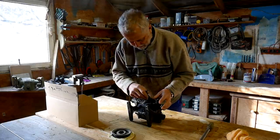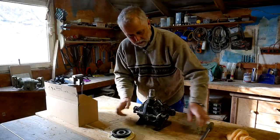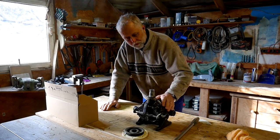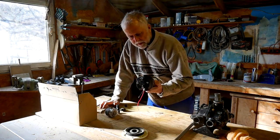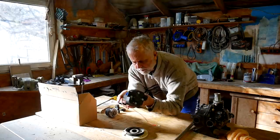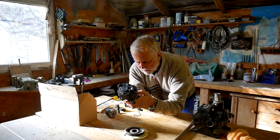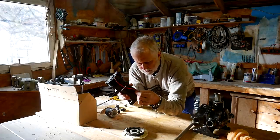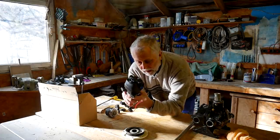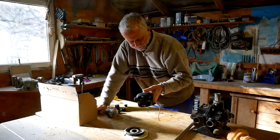I say with two chambers, so that will be going in somewhere. Got all the parts for that one, the manual pump. And for the electric bilge pump, I just purchased this one here. This is a bulkhead mounted bilge pump, which I rather like the idea of. I like the idea of keeping the bilge pump itself up out of the water, not having electrics in the bilge water, keeping the pump up dry. Obviously it has a pipe down into the bilge and out.